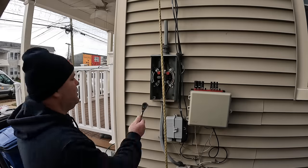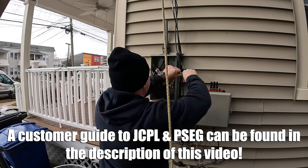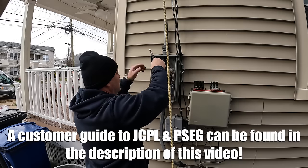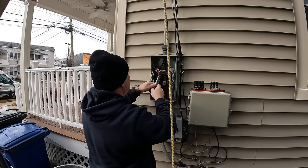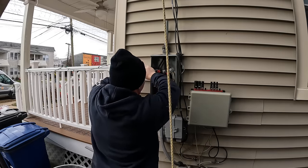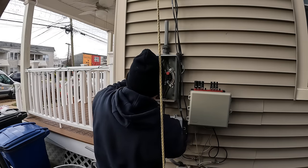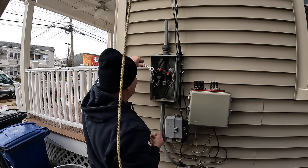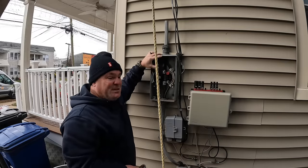So after removing the service entrance cable riser, I need to remove this old meter, and I need to remove the conductors on the line side of the meter, because only one screw was used and it's directly behind my grounded neutral conductor inside this enclosure. And you'll see that I break a couple of these lugs, by no accident but my own. It happens. It's difficult to work with stuff that's been terminated for years. So easy to break these.